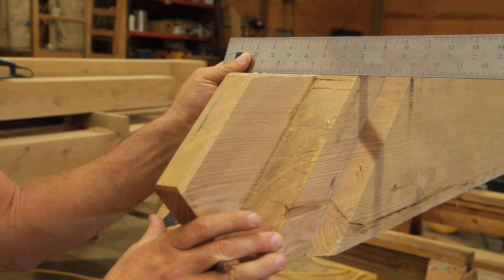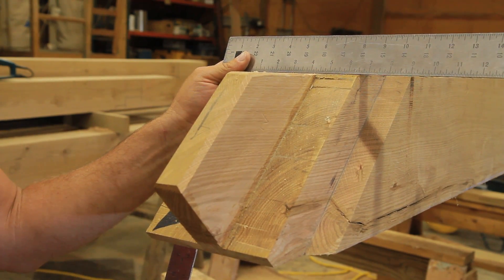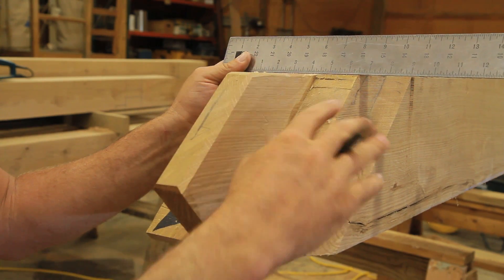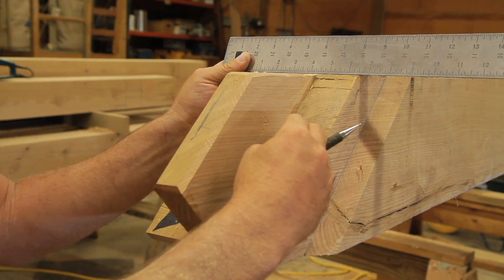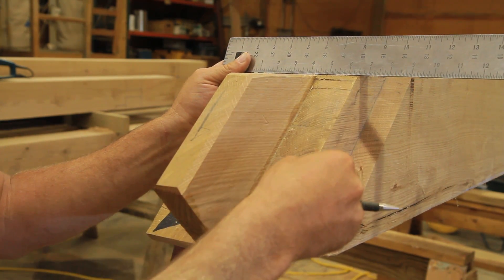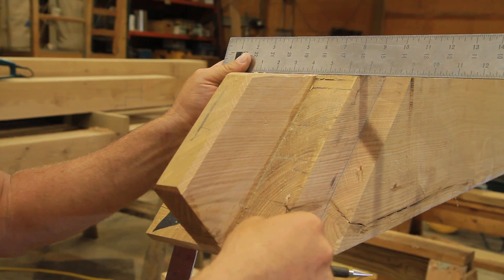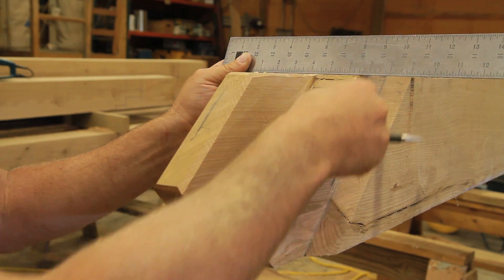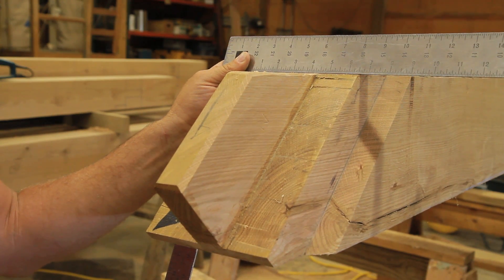This is the part that's going to be fully housed inside the principal rafter. Here at Trillium Dell we house all of our component pieces so that we don't see shrinkage in the frame. This is the tenon, this is the cheek of the tenon, and this is the shoulder of the tenon. You can see the hand tooling marks from back cutting. The only part of the shoulder that bears is this little bit right here, and there's about a 1/16 inch reduction here to 3/32nds to allow this piece to fit really tightly in the housing that we create. The housing is the part that fits this reduced part of the overall timber size.